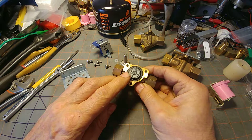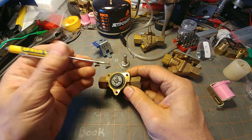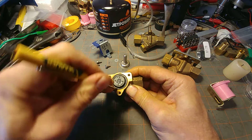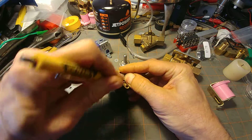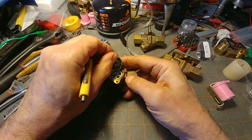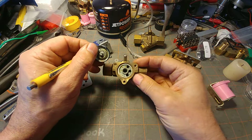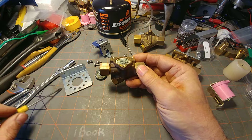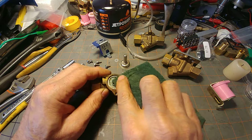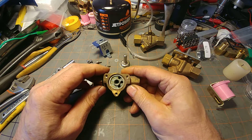There's your diaphragm, which looks very much like the Fluidmaster diaphragm and works on the same principle, as we'll discuss. This is usually bonded — you can see the calcium deposits on this side. Gently pry this open to get it off. Usually there's a lot of calcium buildup depending on the quality of your water. You can clean this up with a gentle rubbing of green cloth or dipped in vinegar to take care of the mineral buildup.